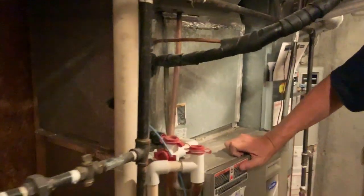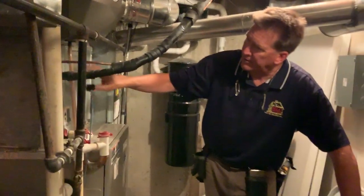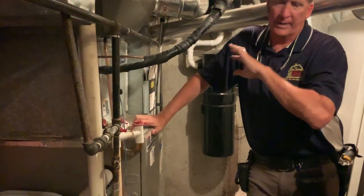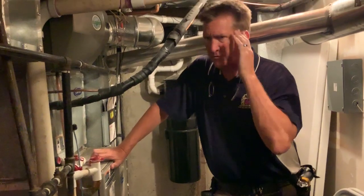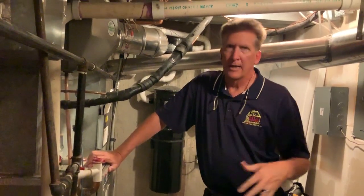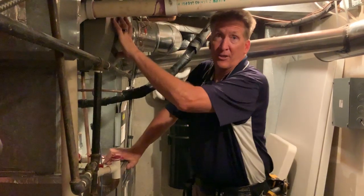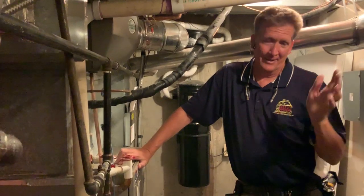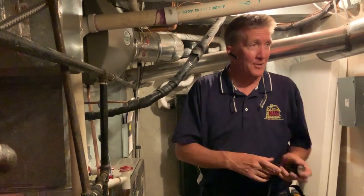I've looked at them. You need to have regular annual service cleaning. Both of these are to the main floor. This humidifier — they're junk to begin with. But this one had major cascading water flow out of it. These are an ongoing maintenance nightmare. Think about it first. What am I doing? I'm spraying water into a heated duct, and I've created a mold farm. The people that sell them tell you everything is fine, so believe what you want.